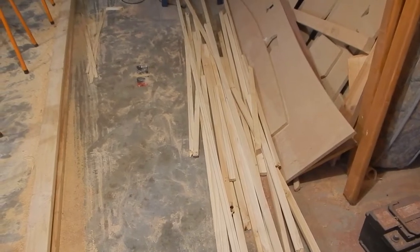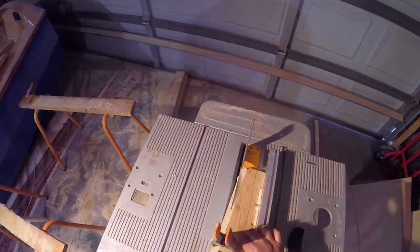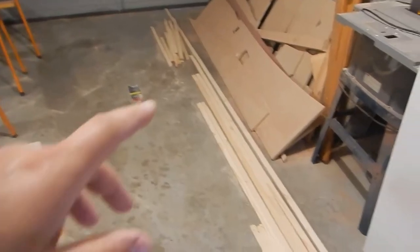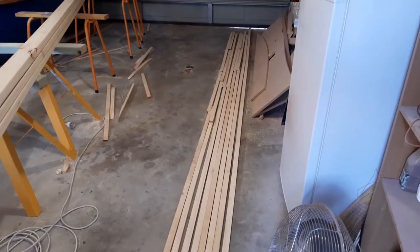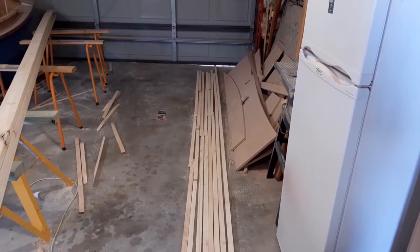I've been going through this wood, trying to snap it at the knots. If it snaps, fine; if it doesn't, also fine. All the stave pieces have got their scarf cut into the end — I just have to fit them all together. One of them is the full length but the rest will need at least one join. I just have to finish the scarf joints, glue them together, finish putting the notches in, epoxy the insides, then I'll be ready to put them together.